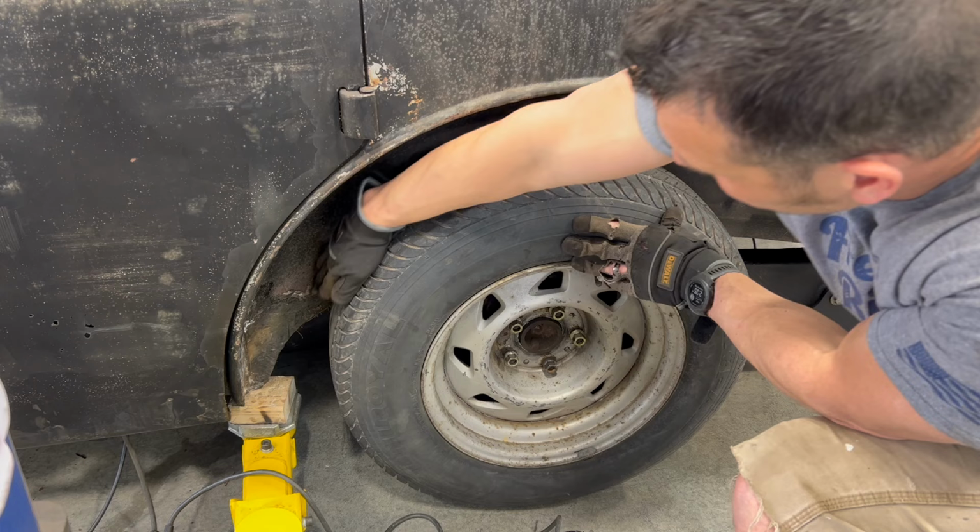And again, it's a rat rod, so we're not worried about all sorts of awesome bodywork here, but I just want this bit of the frame to basically sit right inside here. We've got plenty of room. So if I cut this little step out all the way up there, the body is channeled onto the frame and we get this thing all the way down on the ground. So that is the plan.